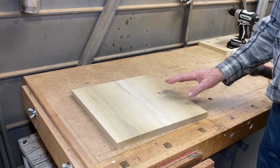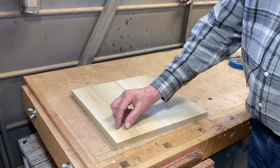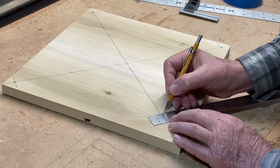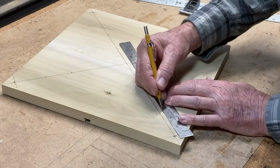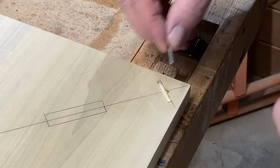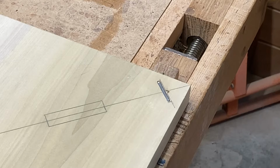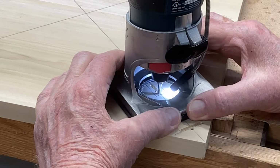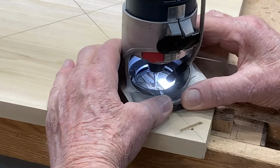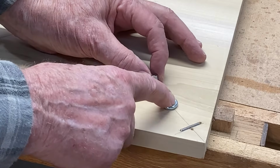This is the underside of the bottom, and this is where all the magic happens. I'll be drilling 1/8 inch hole in each corner that the wire can go through, and then I'm going to use a router and route some grooves in here to mount the tensioning attachments for each wire. This small 1/8 inch rod will keep the tensioning cable from cutting into the wood when it turns the corner. This is the adjustment assembly that I've come up with to tension the 4 outer cables.